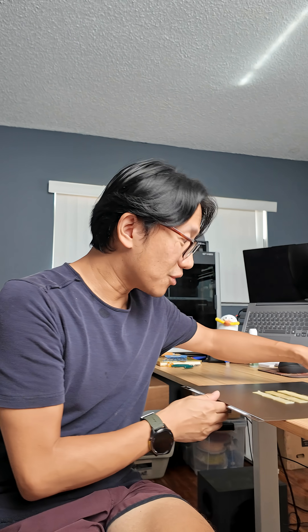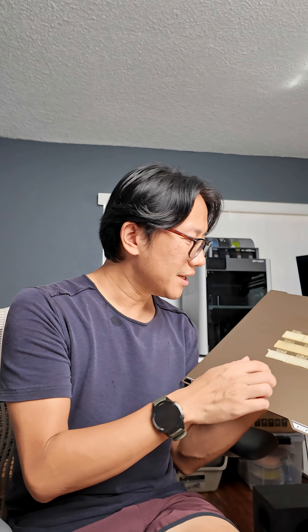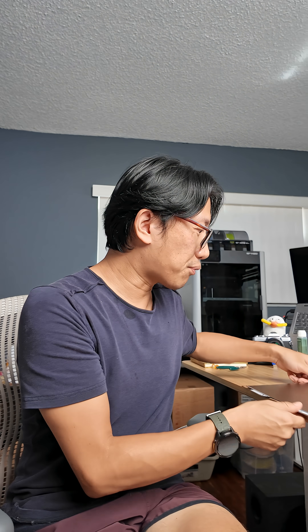The second thing you need to do is flow rate calibration. As you can see, I have a couple of flow rate blocks printed out — choose the block with the smoothest surface, because this is also important when printing with PVA as a support material.